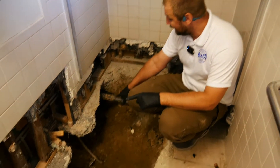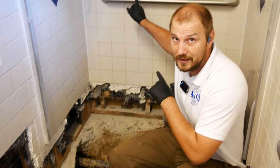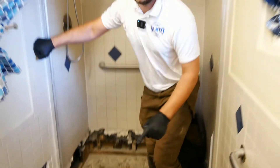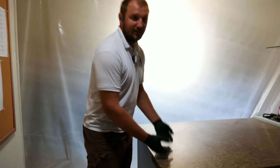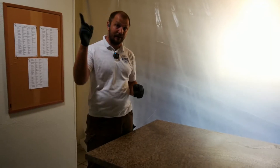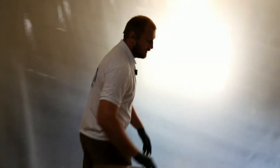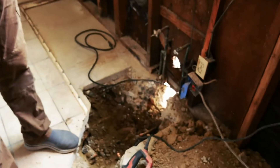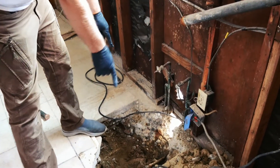The kitchen line — we'll bring a line for the kitchen from here, going inside all the way to the kitchen. We're going to pipe burst the two-inch line. They have a connection somewhere under the island, and we don't want to destroy the island to reconnect the kitchen. We have to go a different way: we'll pipe burst the line. We dug a hole where we're going to connect to the kitchen, and from that same spot we'll run the line for the laundry.